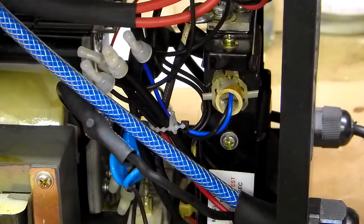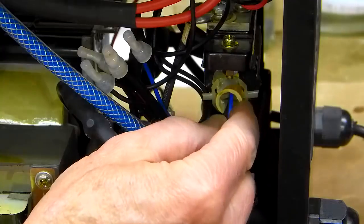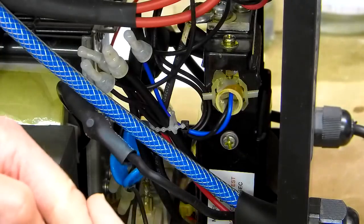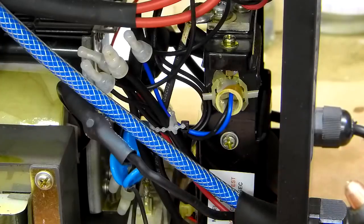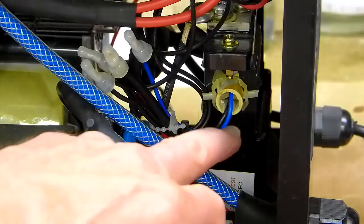Up towards the front of the machine there are some coils and inductors. A blue and black wire goes into a tube that sits in the middle of what they call a current sense coil. In there is a reed switch — a little glass tube with small switch contacts that a magnetic or electromagnetic current will trip. The purpose is: when you pull the trigger on that torch, if the machine does not sense that it's generating a fair amount of cutting current, it will turn off the drivers that produce the current. You'll hear it blow air for about 20 seconds after you let off.